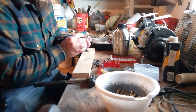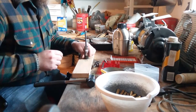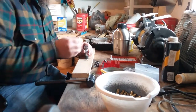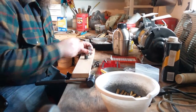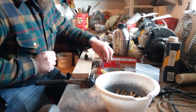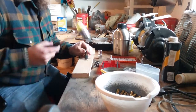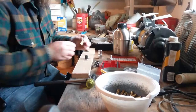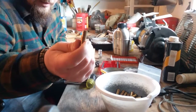Now that you've got a new primer seated home, stick it back on your de-priming die and wrap it until it comes loose of the sizing die. You won't need to use this anymore, so put that down. Next, take your flaring tool, set it in — I like to use the rubber end for this. Give it one or two good taps, and that just puts a very slight flare at the end of that cartridge.